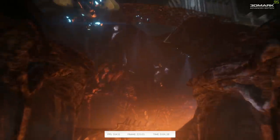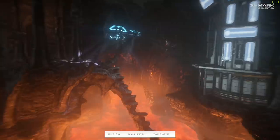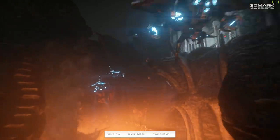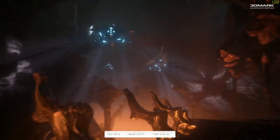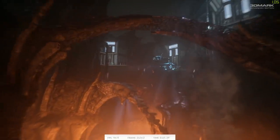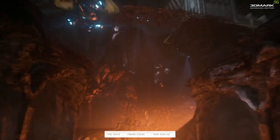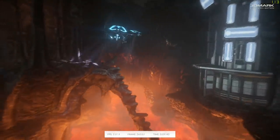The maximum resolution of the BirdDog is 1080p at 60 frames per second — it does not do 4K. NewTek has another version of their Spark that does support 4K video, costing about $1,000. So there are 4K NDI options out there, but the max on this one is 1080p 60. It does support a number of resolutions and lower frame rates below that, covering most of what you'd get out of broadcast cameras and other camera types. Altogether, very good image quality here as you can see.